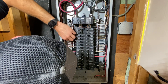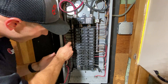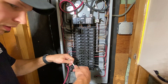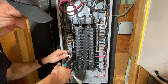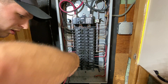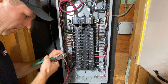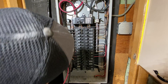At this point you're gonna take your white wire, which is your neutral. On the left side you can see that silver bar where the ground and neutral wires go into. You wanna get it nice and tight — see how I'm bending it to make an L shape. That will make it nice and clean up the side of the panel, then you can measure and cut it. I'm gonna cut it with these Lineman pliers, then take a pair of strippers — I'll use the Lineman pliers to strip the coating. Six-gauge wires are really tough but you should get it fairly easily. Just strip that off and get it into one of those screw holes.